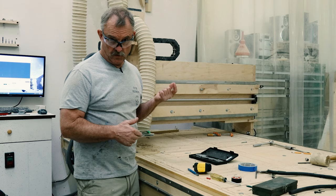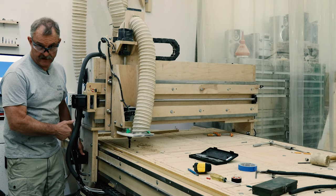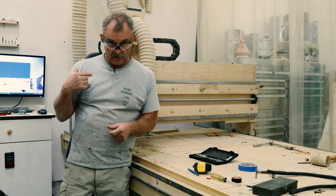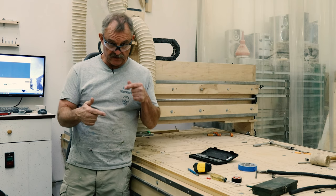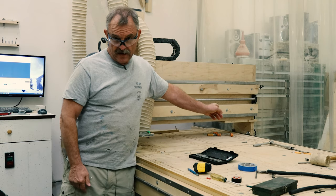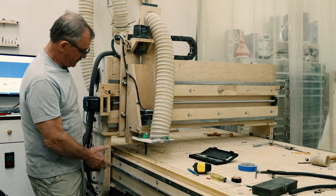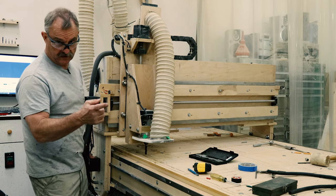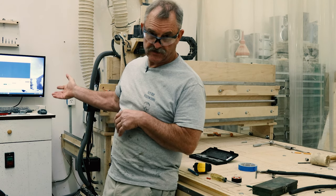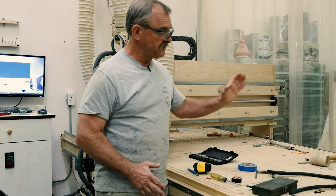I know the difference between the closed-loop and the regular stepper motors now. When I first built this thing I should have used closed-loop right from the get-go. Originally I had the A motor — the slave — set to active low and the X motor set to active high. With this new configuration it was actually running in the opposite direction, so I had to change that: the X is now active low and the A is active high, and it goes in the right direction. The problem I have now is that the motor mapping is different, so it's going twice the distance. All I have to do is get back into the software and change the settings on the motor mapping.